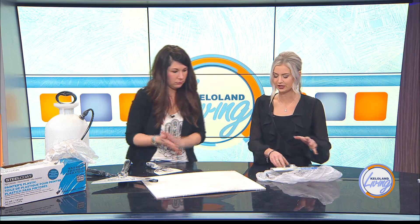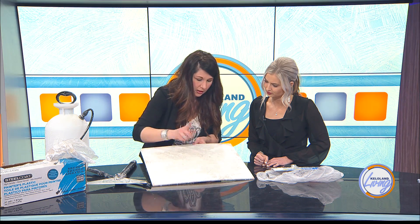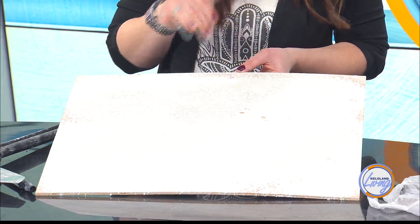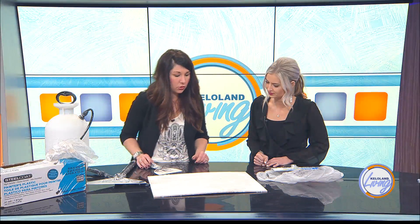Are there different parts of the ceiling where you use the different tools? Yes. The first thing I do is spray and work in sections. If you ever want to test whether your popcorn ceiling will come off, get a spot wet first. Here I have a sample board — when it's dry and I push on it, nothing happens, but up here in the middle where I've got it wet, it comes right off on my finger. A lot of times these popcorn ceilings weren't painted, so if yours haven't been painted, try this first — because once you paint it, it seals it and it's harder to remove. I spray one section down, wait 15 to 20 minutes until it's soft, then get my scraping tools ready and spray the next section while I go back and start scraping.